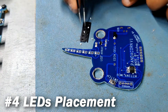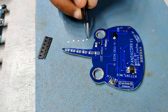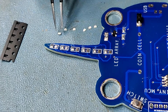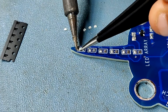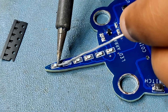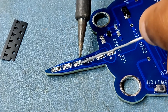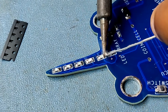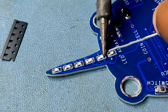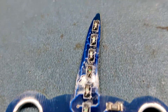There's an additional step: we have to solder the LEDs in an inverted orientation by hand, turning each LED 180 degrees and soldering them to the pads one by one with a soldering iron. The precaution here is not to overheat the PCB — be quick and use a lower temperature like 280°C to melt the solder paste or solder wire.